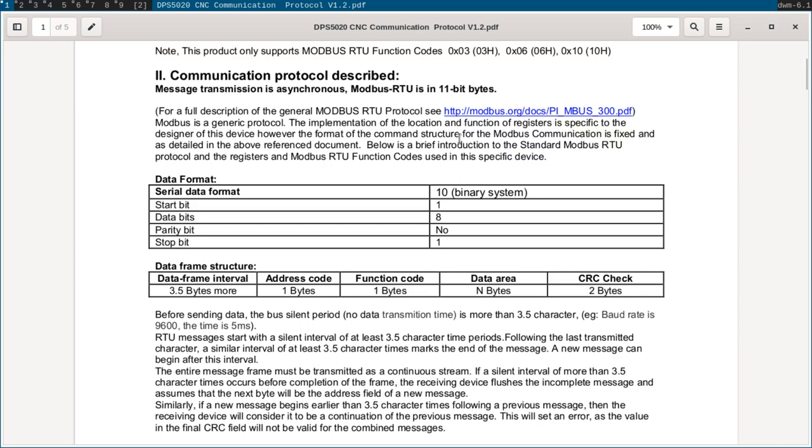You can think of a Modbus message as a sentence, full of bytes which are words. These sentences have an opening gap — like a blank space — to delineate the sentence starting. Then a byte for the address code (who you're talking to), a byte for a function code (what you want them to do), however many data bytes you want, and then a CRC — a cyclic redundancy check. Now, every byte in a Modbus message is 10 bits. You've probably heard a byte is 8 bits, so what's the deal? Well, in serial communication the ones and zeros get interpreted by reading the voltage on the wire at your specified baud rate.